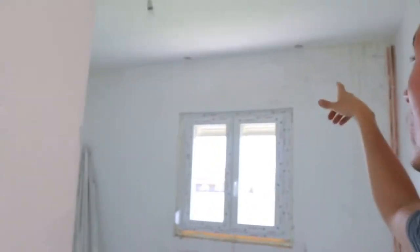For the rooms above, I've drilled through in the right places — two holes in the ceiling — so I can drop a pipe through there and connect it all up in the roof space. There's going to be a 100mm void so everything will be hidden. Because these are concrete floors and not the old voided wooden floors they have in England, you haven't got much choice apart from a voided ceiling or voided floor. More channelling would be a nightmare with this reinforced concrete, so this is the best option.